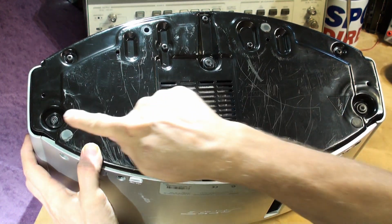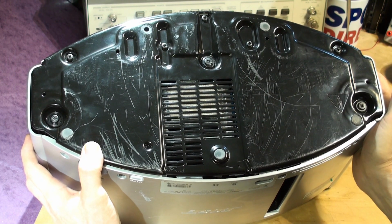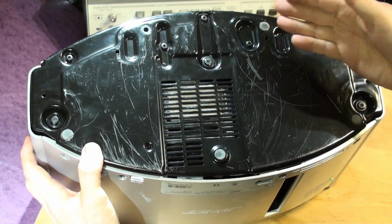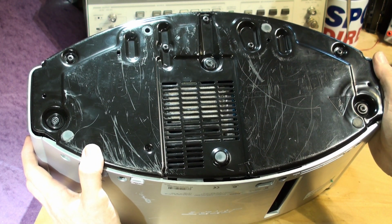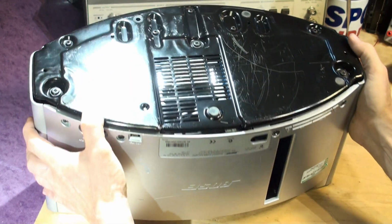And when you take them off, underneath there is a rubber, this is kind of rubber mounted to cushion the dock area from the vibrations from the speaker. You've got a powerful speaker here, and the old iPods had hard discs in, and without this cushioning it would stress the connector and also could cause the hard disk to jump and lose its position. Obviously there are very fine mechanics in there which are prone to vibration. So it's these three screws we're going to take out, and I'll show you what to do. So first of all, we'll just take those out.